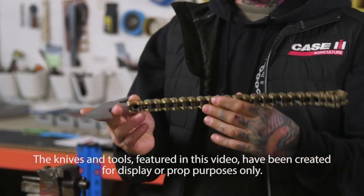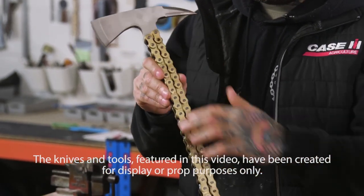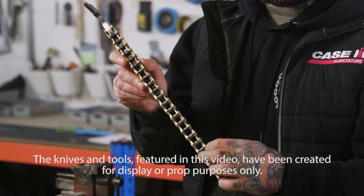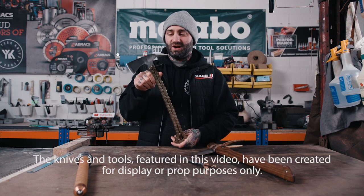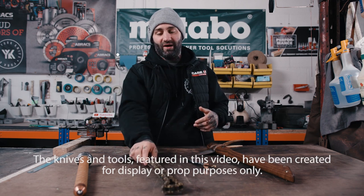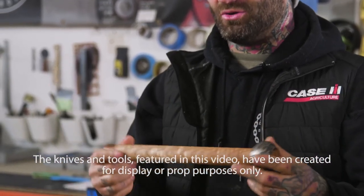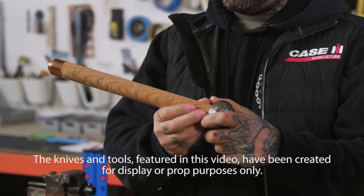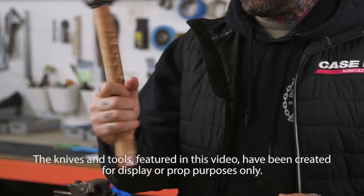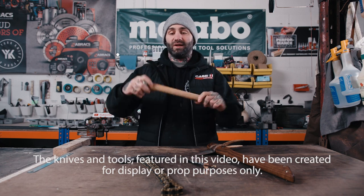Evolving from the chain axe, it's a bike chain axe. There were a lot of problems I encountered — when I first put the chain on, I welded on the top and it was pretty unsightly, so I decided to weld behind so it still looks like a chain axe. The head's also pinned to the chain to make it tighten a lot better. And a tyre thumper — I think I used pretty much every single tool in my workshop on this one. I had to forge the head out, turn this on the lathe, turn down the spike on the lathe. It was putting every idea in my head together to make something I really liked.